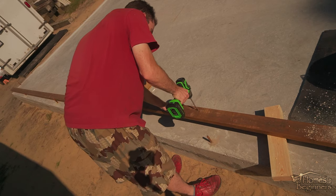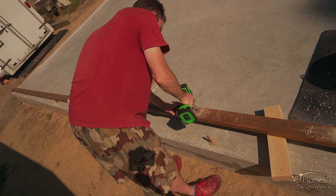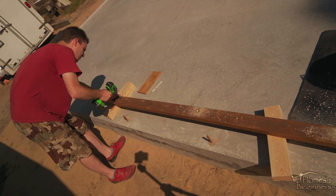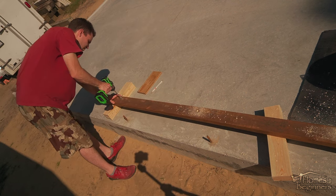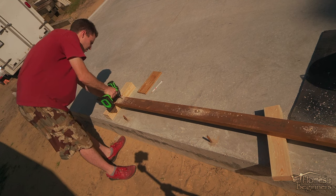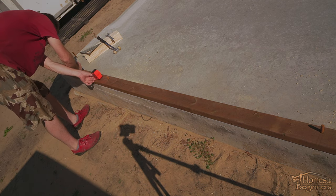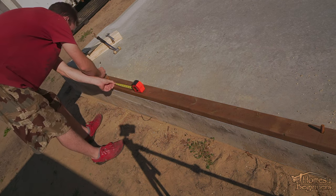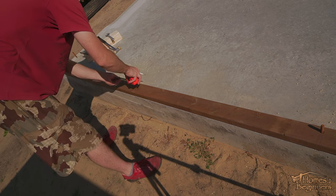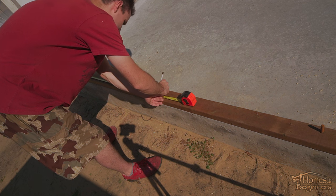The anchor bolts are half inch but I am using a 5/8 spade bit instead. It's slightly larger and this will make up for any problems where something doesn't align, giving a little extra movement so everything is properly aligned and the wall is straight. The slightly oversized hole will be covered with larger washers that will have no problem keeping everything in place. After laying out my studs, I'll show you in a moment how to go about laying out a stud which falls on top of an anchor bolt.